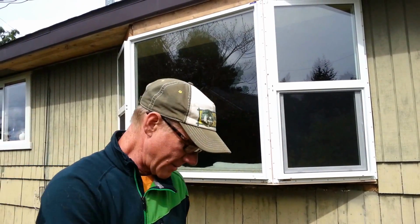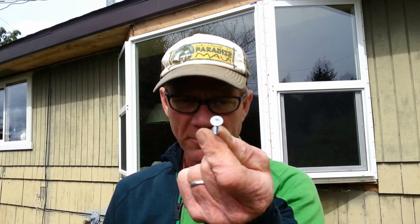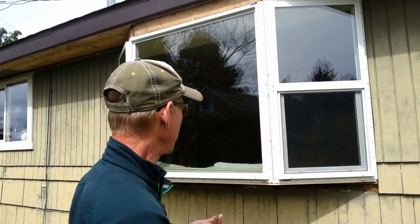I use that poplar plywood instead of a CDX, because CDX is not near as good as this stuff. These screws tend to be roofing screws. They came with some snap lock roofing that I put down. This is the screw you use to screw one side down, and then you snap the roof over. But you can buy this. It's just a nice washer head screw, basically. We're going to screw these into the holes of the window now.